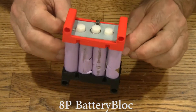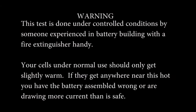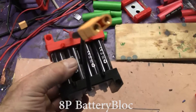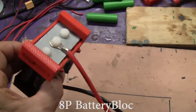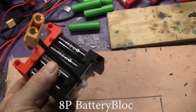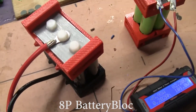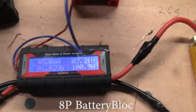Let's go put some current through this guy. We'll swap the batteries out, put some current through it and see how it does. Here we have the 8-pack. I've got some QB cells in it — the Queen B cells. These are rated at about 7 amps each. Not bad — it's drawing 45 amps from 8 cells.